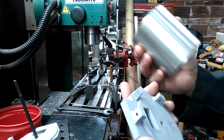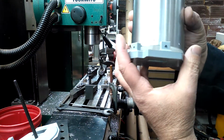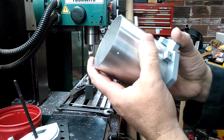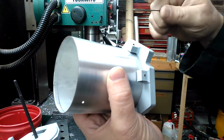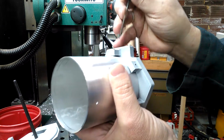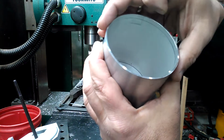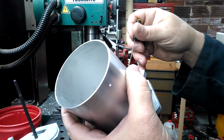Okay, so make sure that there's no swarf in here from previous operations. Put this down in here, I move this over, and I sight through this hole here. What I had to do is put some 4-40 set screws in here with points. They will go into the two existing holes. This will properly relocate this for rotation to where it was when the holes were originally drilled.